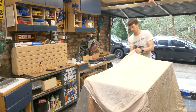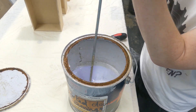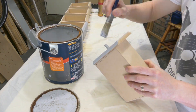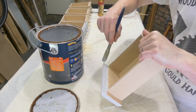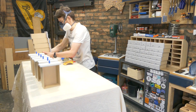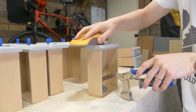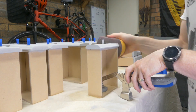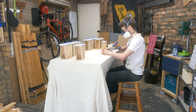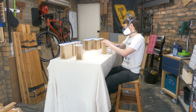Vando pointed out that I really should have painted these before putting the drawer fronts on — and yeah, that would have been a great idea, because then I could have avoided doing it all by hand with a paint brush and just needed to touch things up afterwards. But live and learn. Already in process-driven mode, I did 54 coats of primer, 54 sessions of 320-grit sanding, and 54 bits of blue tape to mask off the knobs. It just flew by — in about three days.